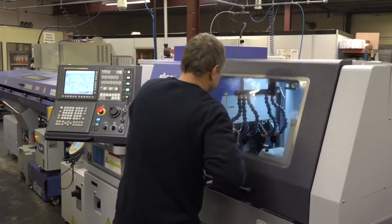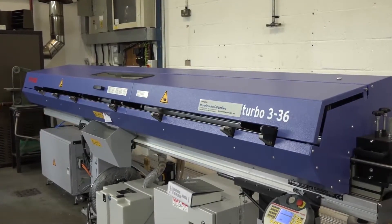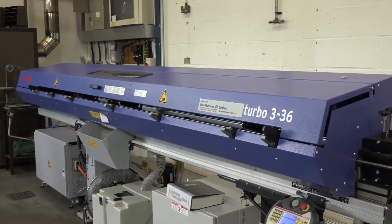We've run a job over there recently for 100 parts. We've gone for the 20mm bar machine; however, we've bought the extension — the optional extra — so we've gone to 22.2mm diameter. We've gone for the 41-tool option, so we have a 9-axis machine.